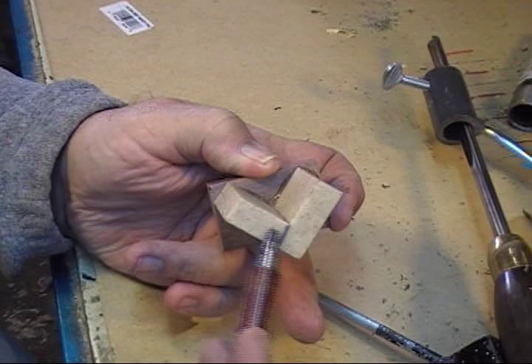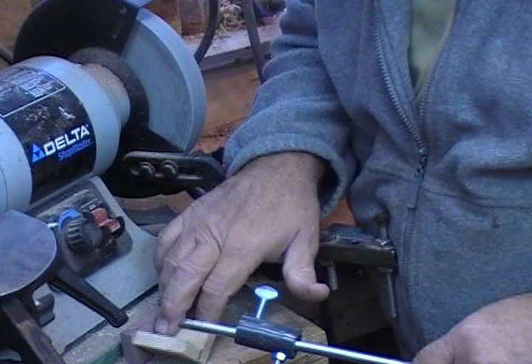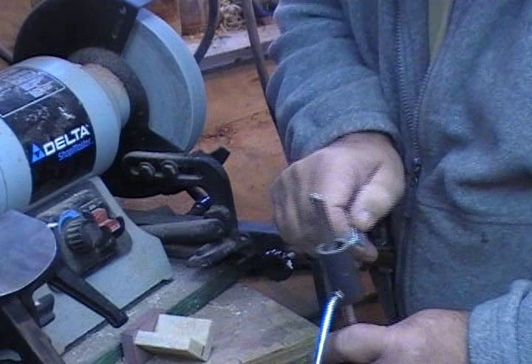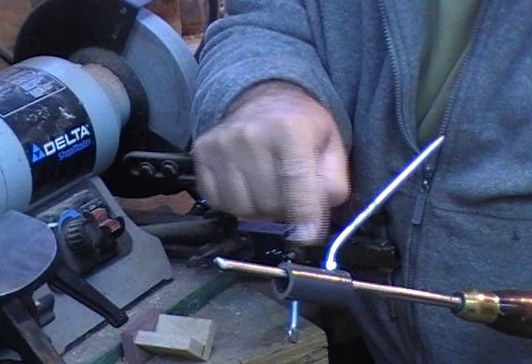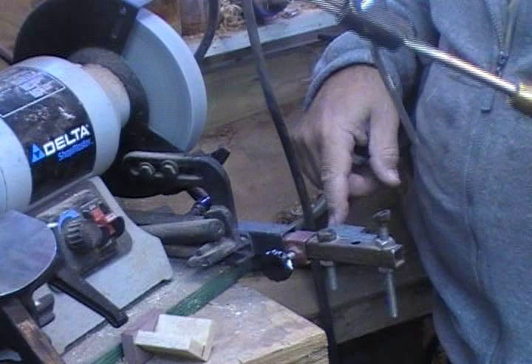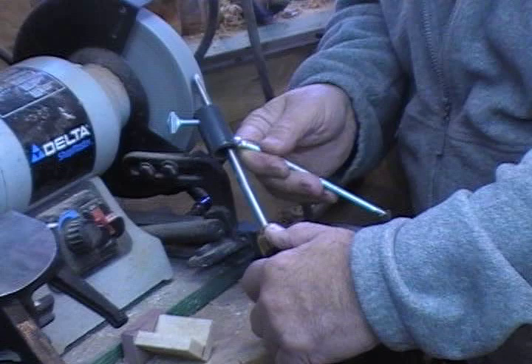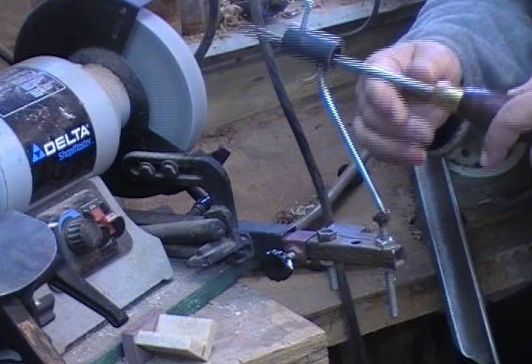Put it now at the grinder. We set our tool out 2 inches. I'm going to do this left-handed to show you how easy it can be done — because I am not left-handed. I'm going to slide my rig up, get my two inches. I'm going to look down over the top and see that this is square with this, which lines up with that. My basket is 7 inches out from the face of the wheel, 4 inches down from the center of the shaft — that's the basket for my Ellsworth cut. Don't dilly-dally on the tip. Make sure you're in the basket. If you stop on the tip too long, it'll go flat. That's all it takes.